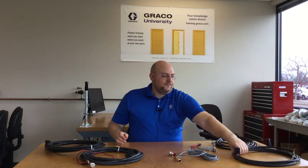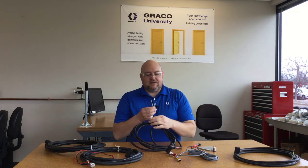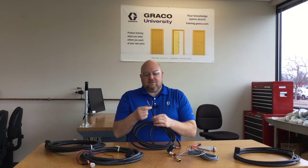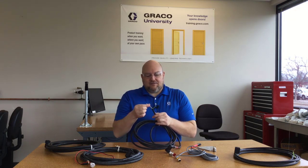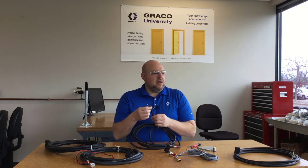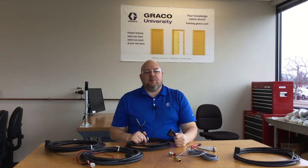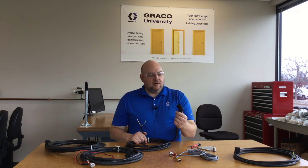When we go to the CPC cable — the three-pin CPC — we have the same colors as the DIN cable, and this throws people off again because they're expecting red for positive and black for negative. Black is negative, green is ground (which can typically be clipped off), and white is your positive. Don't let that confuse you. Also, even if a pump originally came with a five-pin cable, you can hook up the three-pin cable to your five-pin pump because the two power input lines are the same; you just won't have those other conductors for the remote function.